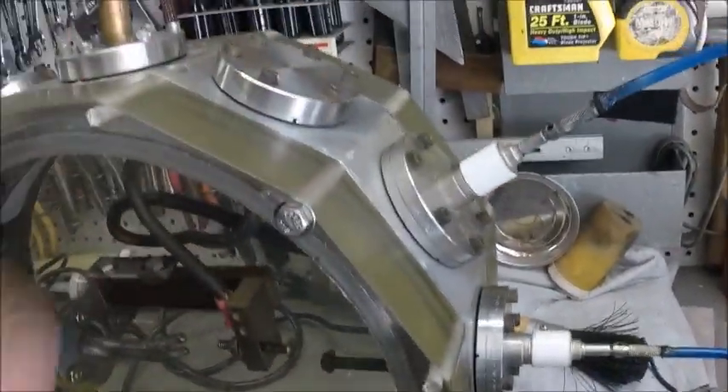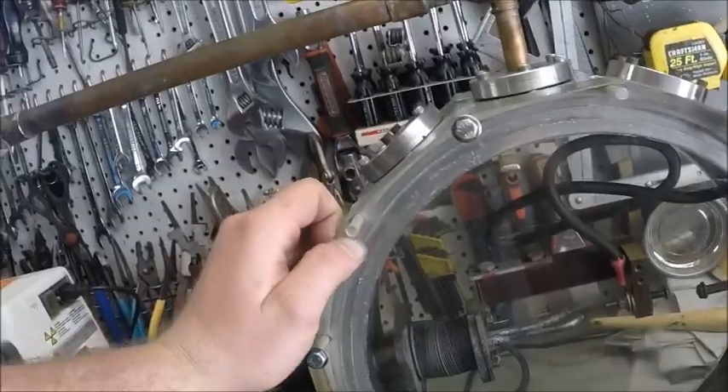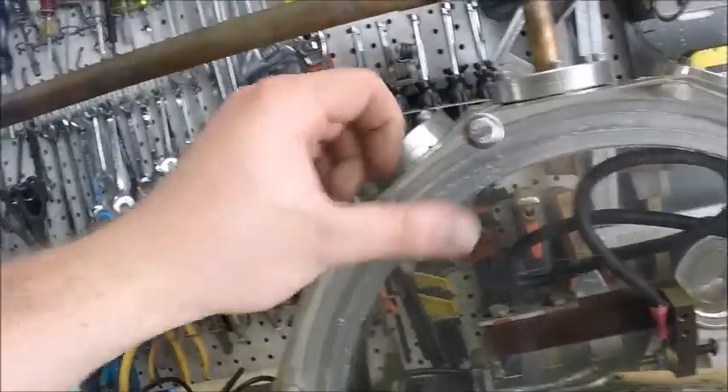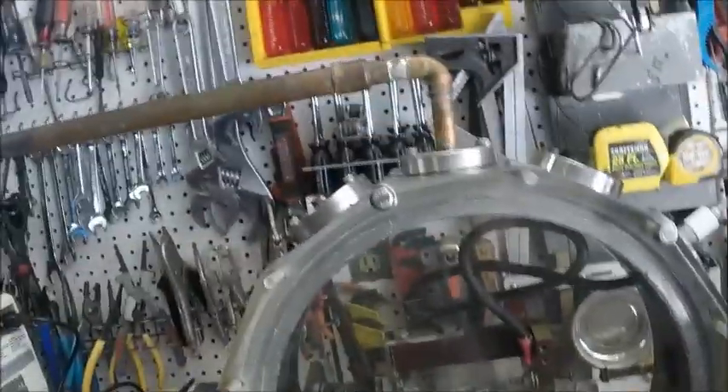The seal is maintained just around the face of the aluminum. Here you can see a little bit of squeeze-out of the silicone caulking that I used. It's pretty neat because you can see right through the acrylic — you can see where your bond line is complete when you apply the silicone sealant. Squeeze it down and it squeezes out; you can see air pockets as they form, if any form. In my case I got really lucky — it's all flat.